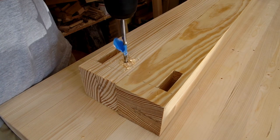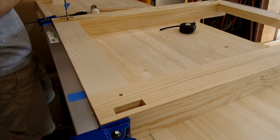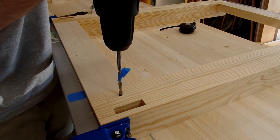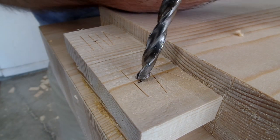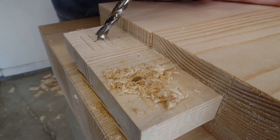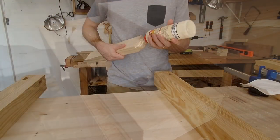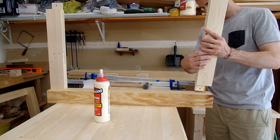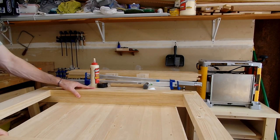Once all my tenons were cut, with the tenon in place, I drilled a hole through the mortise. Then I could assemble the tenon and, using the drill bit, transfer the hole location onto the tenon by pressing down on the drill bit. Then I took the tenon back out and instead of drilling directly where the drill bit mark was, I offset the hole slightly towards the tenon shoulder. This creates what is called a draw bore mortise and tenon. By offsetting the hole on the tenon, when I hammer the peg in it causes the tenon to get cinched up tight to the mortise, making the joint a tighter fit while the peg ensures the tenon stays in place.